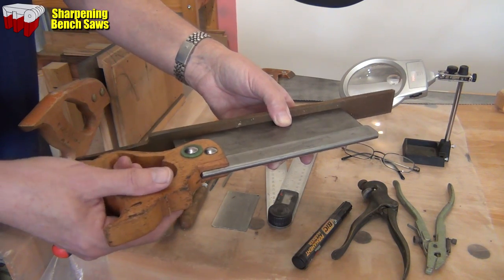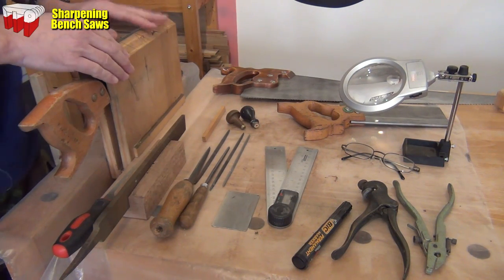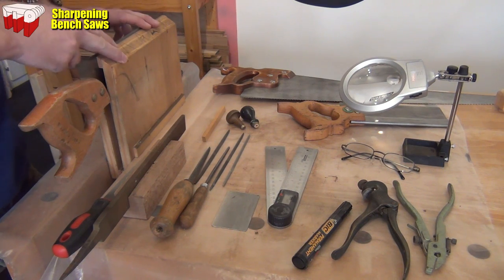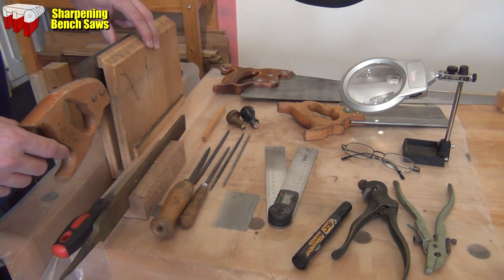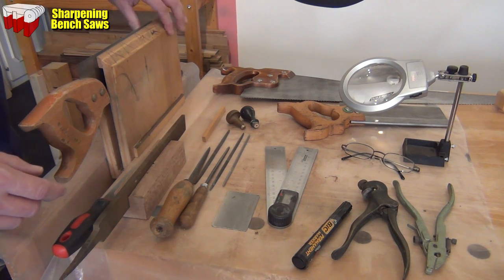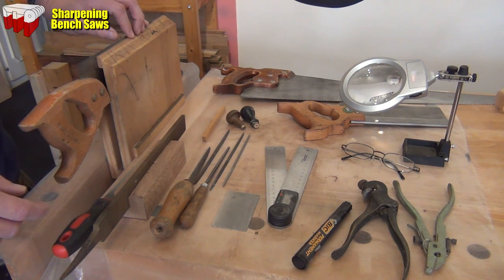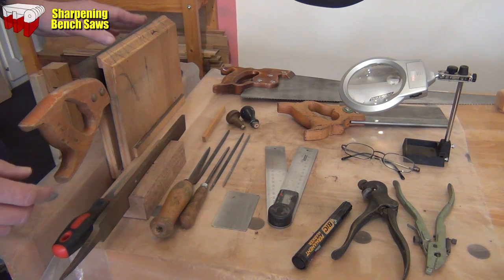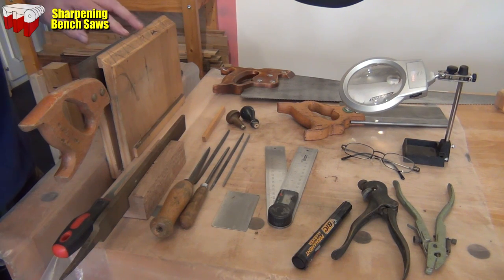You can also do it in a saw vice. Talking of which, you will also need something to hold your saw - and this is a saw vice, this is a homemade one. I've shown how to make this on the channel so if you search for my videos you'll find that video. Very simple to make. You can get metal ones - I think they're probably in production again now in limited numbers - but you can get antique ones and there are various styles of wooden ones that you can get hold of. Really what it does is hold the saw plate nice and tight up here along where the tooth line is and stops the teeth from vibrating when you're filing them.